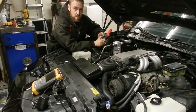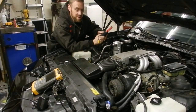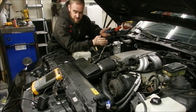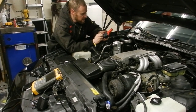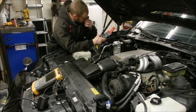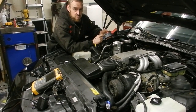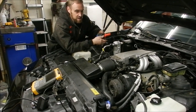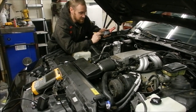You can probably hear that blower motor running right now — that is because I want to do one more test here and show you what DC motors can be tested with. It is a low-amp current probe. So basically we are just covering current probes today. This is an OTC 60-amp AC-DC current probe — it is a relatively affordable unit. There are some more expensive ones out there, but this does have a couple of disadvantages.